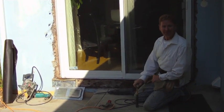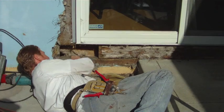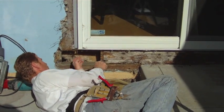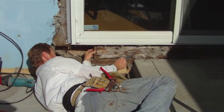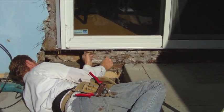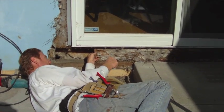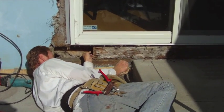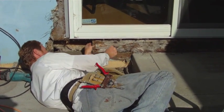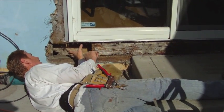The mud sill is in great condition. We just got rid of the vent and took all the stucco off here. I'm going to go ahead and cut this two-by-six. Looking at what they've done here — almost every job folks do things a little differently, but nothing we can't handle. I'm going to cut this rotten piece out, sister another piece in, and put my new vent in.